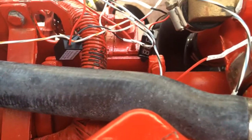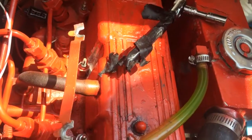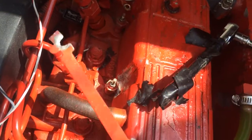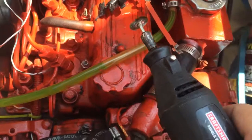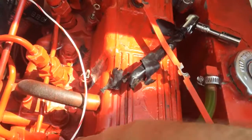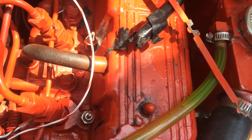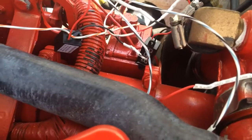I'm going to mount the meter in a minute. Over here I've taken off the connection between the glow plugs — here's one glow plug, here's another, here's another. I've cleaned this all up so all the connections are nice and bright and shiny. To do that just use a Dremel tool with a little wire brush on it and you can clean all the connections up. I've added in a wire here which I'll put right on the end — the glow plugs get fed over here but I'll measure the voltage at the far end, so we'll be able to see on the glow plug meter what the voltage is. I've got one more meter I might put on the starter or on the solenoid.